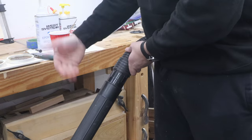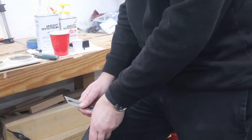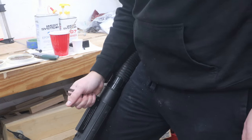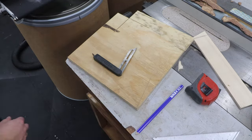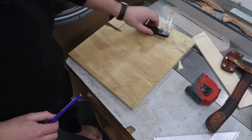Next, I try to figure out a more neutral wrist angle for the handle and measure that angle using a sliding bevel. I'll make the handle out of a piece of scrap three-quarter inch plywood. I'm sort of free-handing the shape, using an axe handle as a template for the grip.